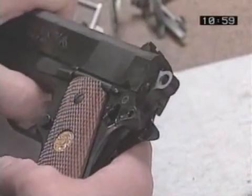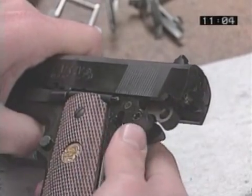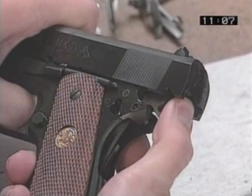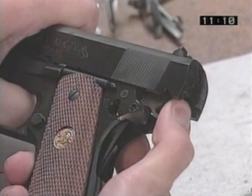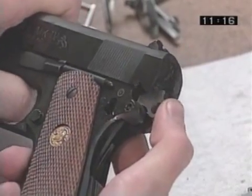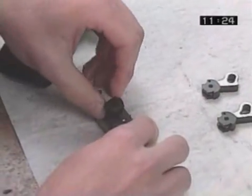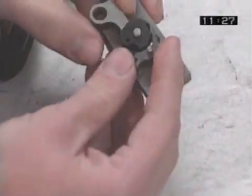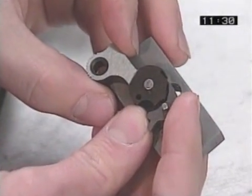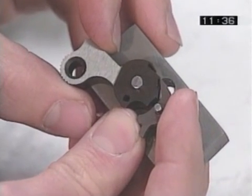Now this hammer here, when you push it all the way back with the slide, it's not engaged into the hooks right now. But you can take your thumb, just barely pull the hammer back. It takes just a little bit, and there it's engaged. You hear it click. Right. Now, it's not that the hammer's too short or anything like that. If you look on the sear block here, you take a sear and hammer, what it's doing when it's not cocking is it's getting to about right there as far as the slide's letting the hammer go back.